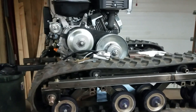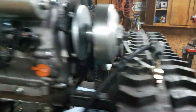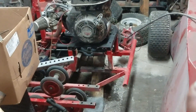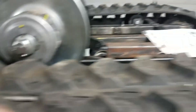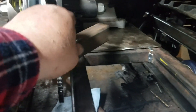One of the cool things was — I don't know if you work on stuff and once in a while it actually works right. But since I got the torsion suspension in, I put a piece of plate up here and took my motor and just set it up here to see how it sat with my differential underneath. My other vehicle had the differential on top of the rails and I had to build a stand like six inches tall to miss the differential. This is something new so I didn't know how it was going to fit, and I was very pleased to realize this motor's fitting on here perfectly. The only problem I have is a little bit of clearance with the track, and I'm going to remedy that by just putting it up an inch and a half higher. An inch and a half is a whole lot less than six inches, so I'll take some of the stock I made the frame out of and build it into that plate there.